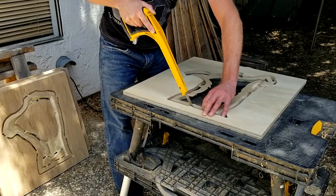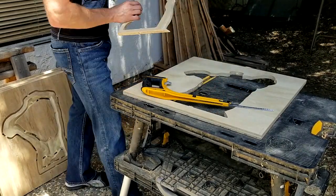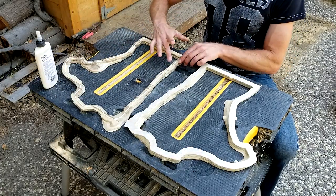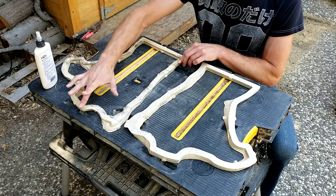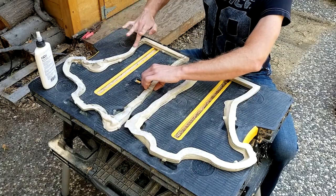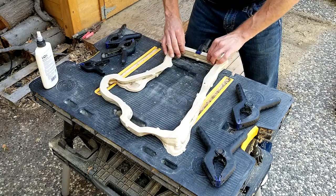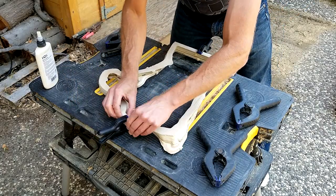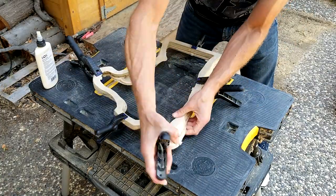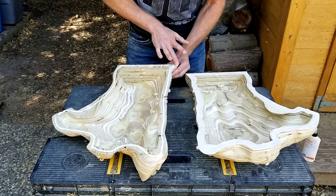After several days worth of CNC routing, I cut the tabs with a handsaw and took the shapes out of the panels. I glued them together with regular wood glue, which I spread out in a generous layer on both sides to minimize the gaps between the pieces. I first stuck them together in pairs for easy clamping, let those dry and then repeated this stepwise gluing process until all pieces were in place. With all these rounded shapes, the protruding stumps of the tabs provided good handholds for the clamps.